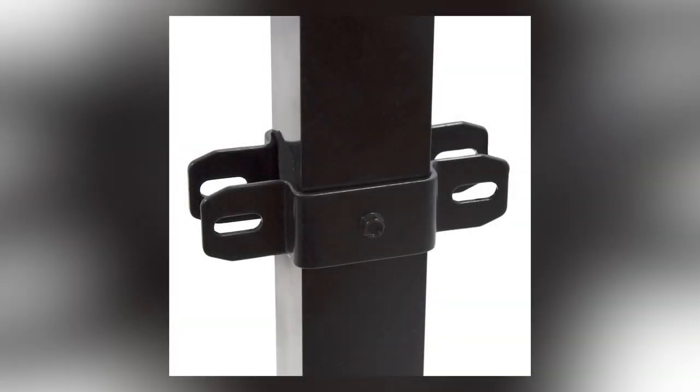Let's start with the fence brackets — the pieces that connect your fence panels to the posts that go in the ground. What you get from most competitors is called a strap bracket, a thin piece of stamped steel that wraps around or butts up to the post. We don't like those stamped steel brackets for a few reasons: they're very thin, bend easily, and rust eats through them quickly. They also don't fully encapsulate the end of the rail, so you can often see daylight and gaps between the rail, bracket, and post. Lastly, they instantly give away it's an off-the-shelf fence, especially the wraparound type that are tough to keep level along the entire fence line.